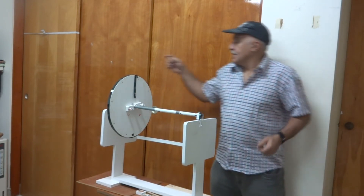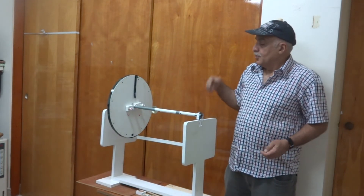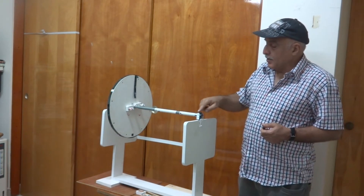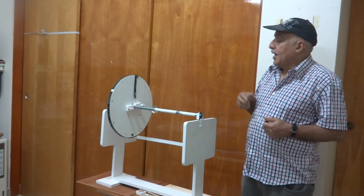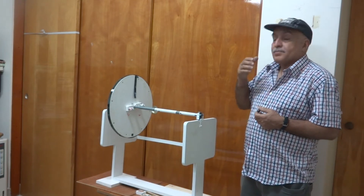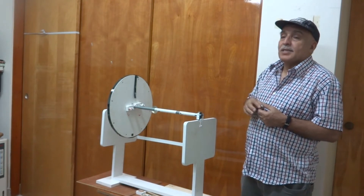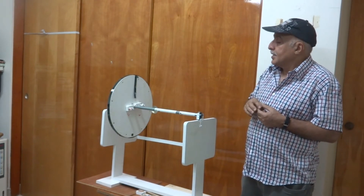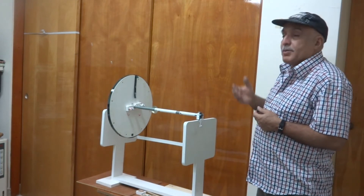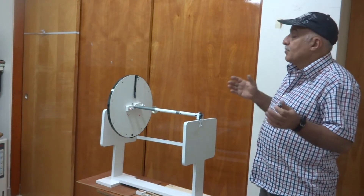You can see here there is one bearing, and also on the other side there is one bearing. So when it will be rotating, there will be a force acting on the bearing. Due to that force, the bearing can be damaged, or some parts inside the rotating machinery can touch the casing. Also the electrical consumption will be high, and it can vibrate also. So all these things we want to avoid.